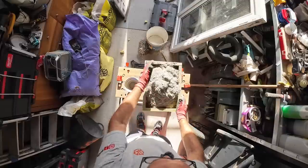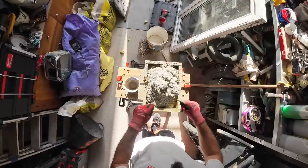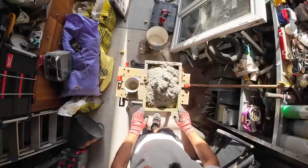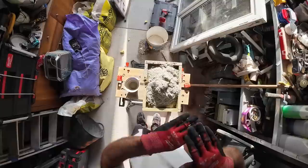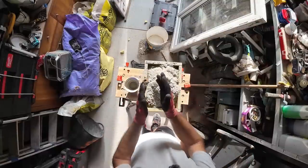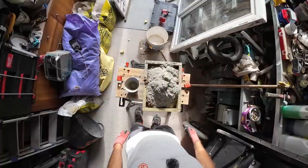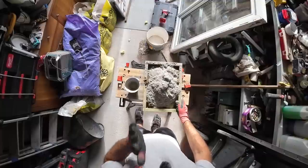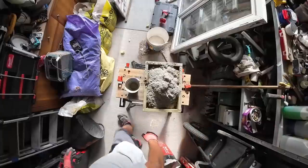So it's quite heaped over, so hopefully when it's mixed it doesn't go down, it doesn't reduce too much, because I want to make sure this is full and levelled. And that's the other thing about when you buy padstones, they're in a mould and the mould's always chamfered, so when you're trying to put steel on top of the padstone, it never sits flat. It always sits on a bit of an angle, which is a right pain. When we worked for A&E, they used to get their padstones on the table saw and cut a flat surface onto the top, which is a good idea, but we don't always have them.